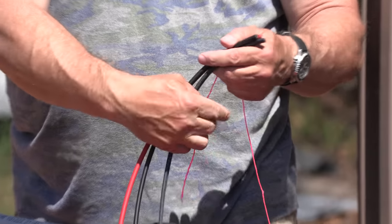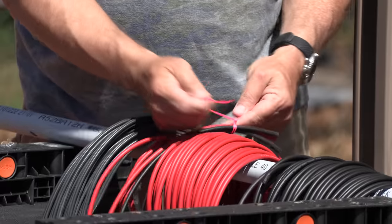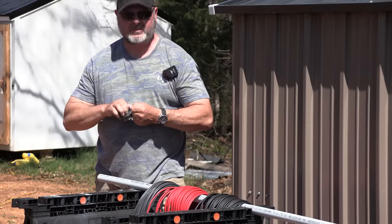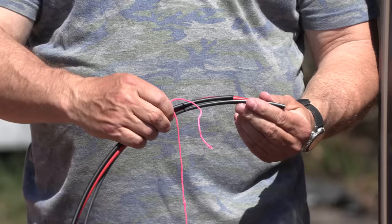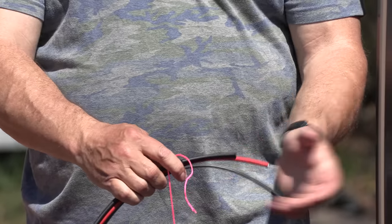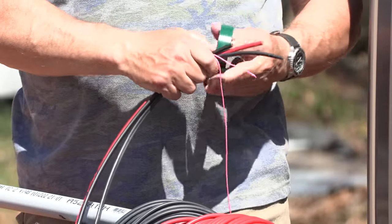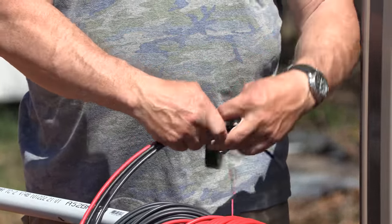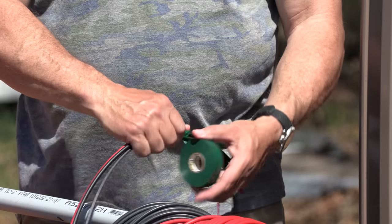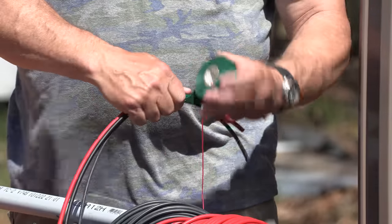I'm going to tie a knot around the base of the wires, then tape it — the knot won't hold on its own but it keeps the wires together and makes it easier to tape. What I've found in the past is to stagger the wires, so one wire is a little bit longer than the next, and the next — that way it's not one big giant end coming at the hole all at once. When taping, don't make wads of tape. If you make a big wad it's going to hang up. Keep the tape smooth and narrow so it goes through the conduit a lot easier.